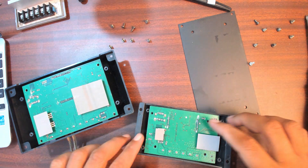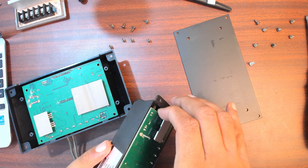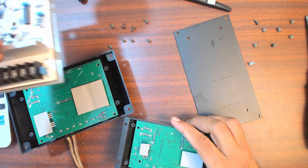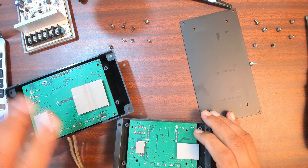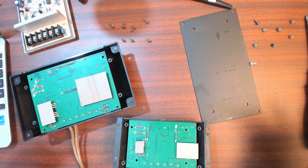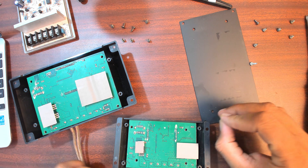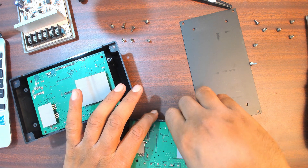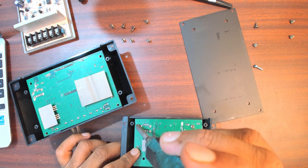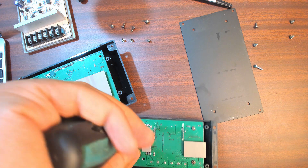So that was the difference between the three in terms of design and function. I'd recommend: if you're starting out, buy a cheap PWM controller like this one with the correct current and voltage rating for your panel and batteries. If you want to go all-in on a budget, buy something like this mid-range MPPT from AliExpress. And if you're going properly serious, you're spending at least thousands of dollars on something running at 48 volts with bigger batteries, proper controllers, and maybe even a Tesla roof.